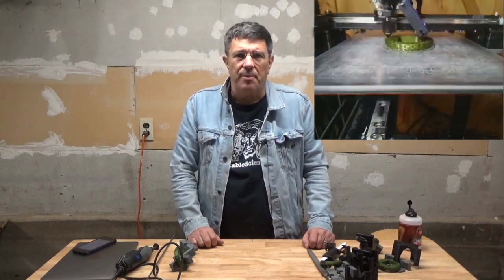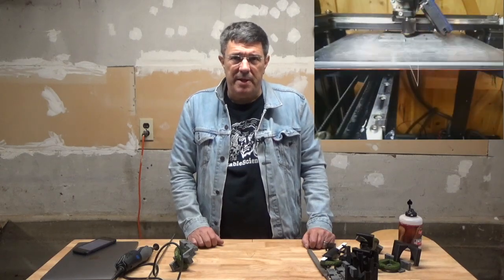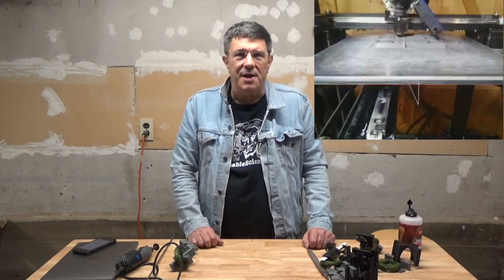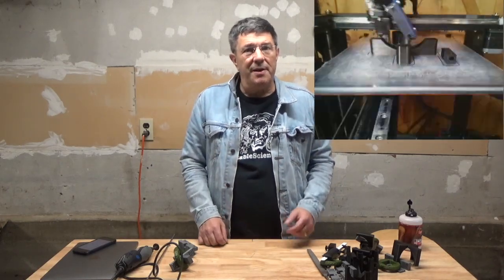We printed our parts in PLA for a 0.4 millimeter nozzle, two perimeters, three bottom layers and top layers, a 20% infill, and a 0.2 millimeter layer height. As you can see, we printed the cross in gray and the knot in an olive green as an aesthetic nod to our Celtic design. There's just a few other parts and an optional stand that we printed in black.